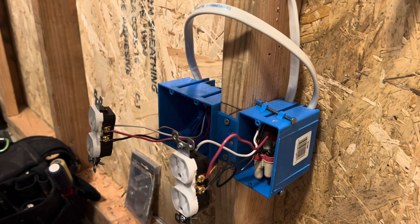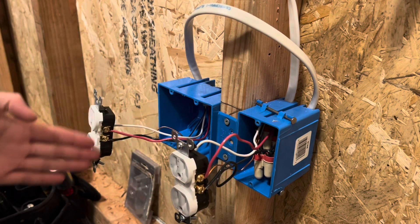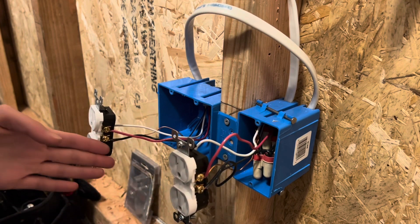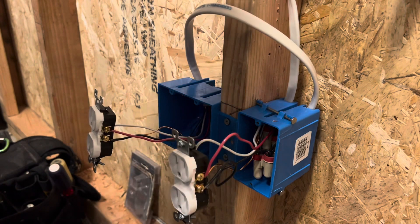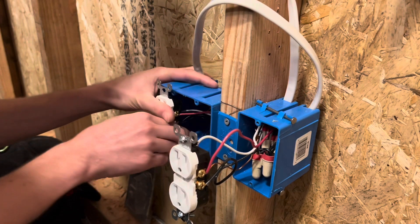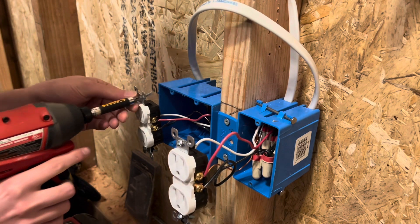You're not going to have 100 in a single room, but it's pretty common to see six or four of these together in a room. If your contractor is really cheap and you're not putting in any ceiling lights, you're going to see this application where there are multiple half-hot switches around the room so they don't have to buy and install another light in the ceiling. So I'm going to go ahead and screw this together and then show you what this looks like.